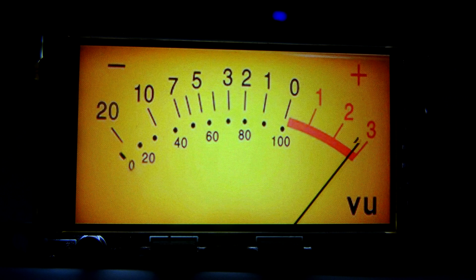One thing about the VU meter mode — the arm that swings around on the big single meter breaks up just a little bit with some tearing towards the top, as you'll see in the video. The sweeping motion is also a bit erratic. On old receivers, amplifiers, and tape decks, a little capacitor was usually connected to give a nice smooth flowing sweep. On this one it's a bit erratic, as you'll probably see in the demo video at the end.